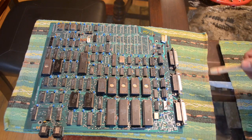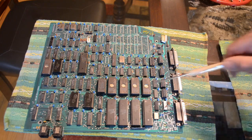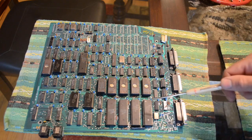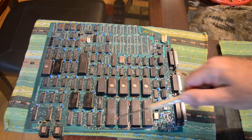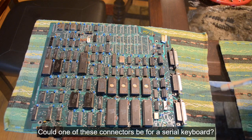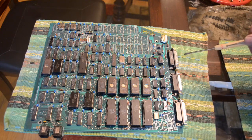We've got three D25 connectors — two male and one female. And we've got two telephone jack style connectors. Looking at the traces, the traces from one UART go down to these two jacks, and the traces from the other go forward to at least two of these D25 connectors up here — I believe it's actually these two over here.